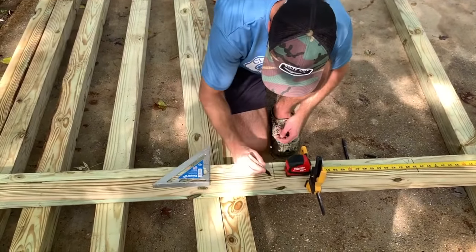I'll leave a link in the description for the materials I used, but you're gonna cut your piece of trim so that it covers the entire butt edge of that outside corner, and then you're gonna start by installing it on the less visible side. In our case, this is the side of the shed.